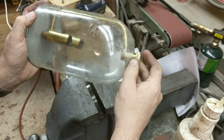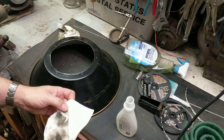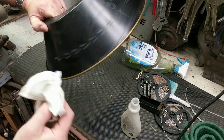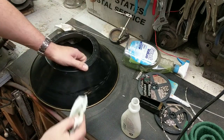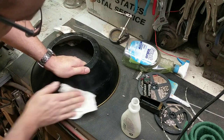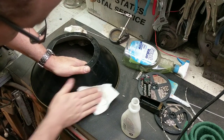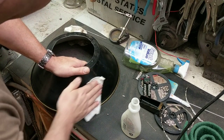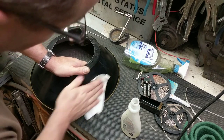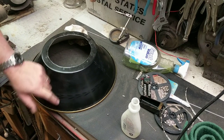Next I'll shorten up these brass threads a little bit to accommodate the final length of that ring. Here I'm using acetone - aka nail polish remover - to remove this hand-painted detail on this old shade, some kind of gold detail that they painted on. I'm going to be painting this to look like it's been enameled, and any visible pattern underneath my coat of paint is going to ruin that illusion. If I had to, I'd hit this whole thing with paint remover to get it down to bare aluminum - whatever it takes to get it down to a physically flat surface.